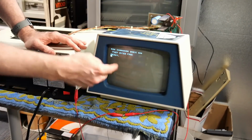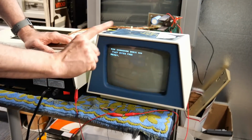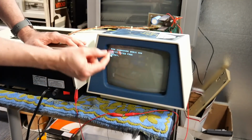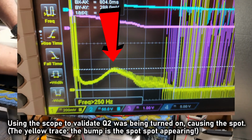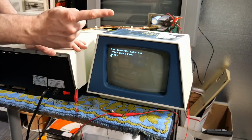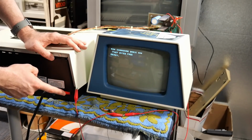And sure enough, when I installed it, I saw maybe the tiniest of improvement when I had it turned up, giving 85 volts to the focus grid. But he thought that this could allow current to leak through to the cathode driver, causing the dot when you turn it off. So let's see, with that removed, and I put it back to stock configuration where grid G4 is grounded again. Here we go. What's going to happen?